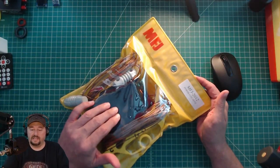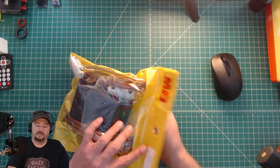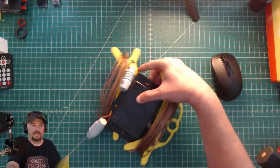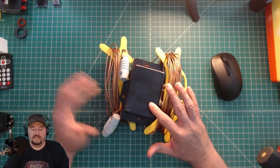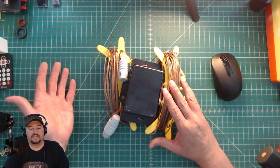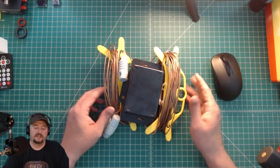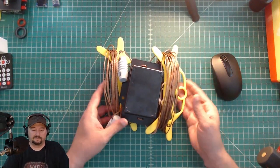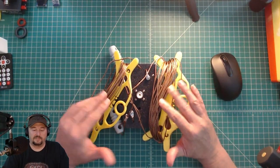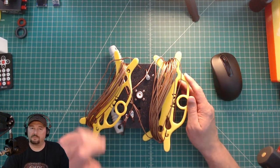This is one I recently did a video on — MFJ sent me this antenna free of charge for testing and evaluation purposes, so I want to make that clear. It has a transformer box with a choke balun and a 4-to-1 balun, and two copper elements of different lengths — this is an off-center fed dipole, good up to about 300 watts. You can use it on 40, 20, 10, and 6 meters. It's one of the best performers I've used — I was very impressed and immediately started making some of the furthest contacts I've ever made once I put it up.